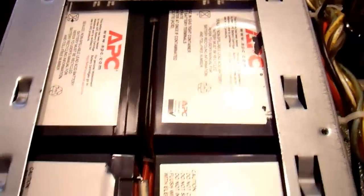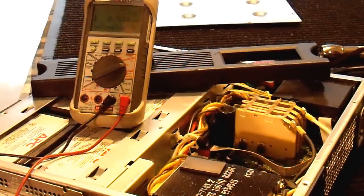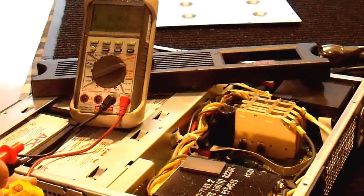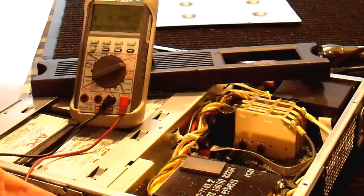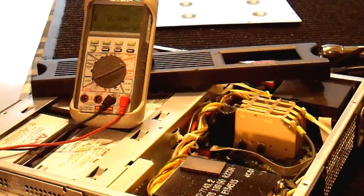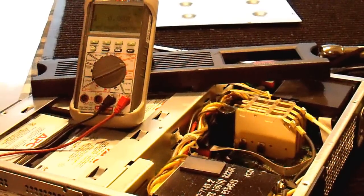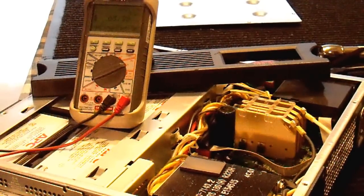So I'm gonna bring my attention over to the battery itself and see if it's just the battery that's bad. To check the battery, I'm just going to use my old Craftsman multimeter here. This is supposed to be a 24-volt battery — you can look up the model number on it. It's a 24-volt battery in these, which means that I can't just use a standard automotive battery to run this, but more on that later. Let's put the multimeter on it. And I get 7 volts. Well, that's probably not right. So this battery is most likely junk.